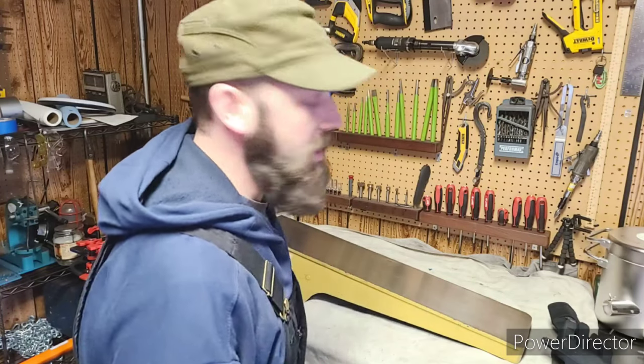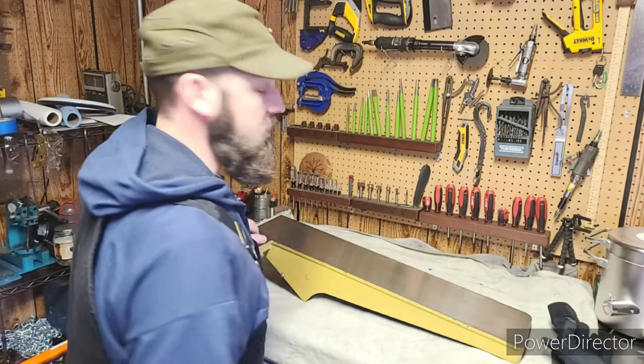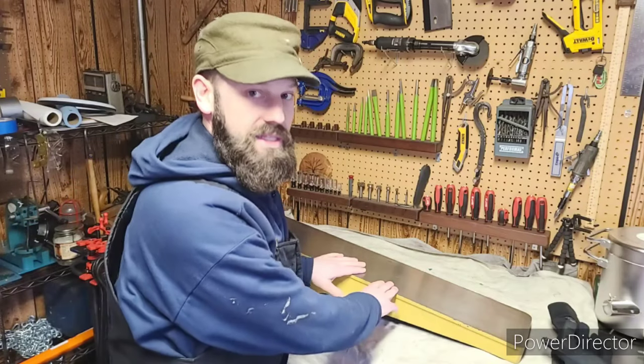So how do you repair these cast iron parts? There are a couple of options. Some of these are weldable, and the way that you weld these parts is by meeting certain conditions. One of those conditions being preheating — you need to preheat these parts up to a temperature warm enough to the point where you can barely hold your hand on the part. We have to do this to prevent the part from rapidly cooling. If we heat up just this area to weld it and the rest of the part is cold, that cold area is going to be a big heat sink, and that rapid contraction is going to cause the weld to break. So you have to preheat the entire part.